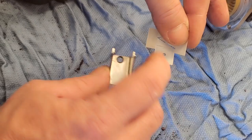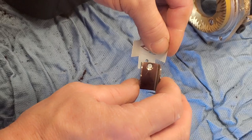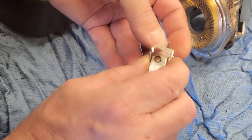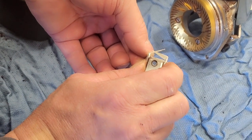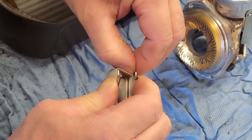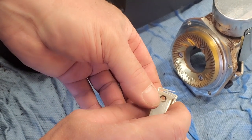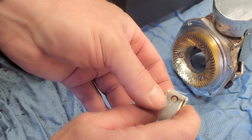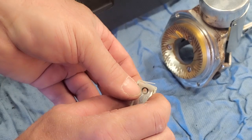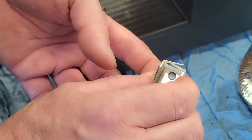This is the clump crusher — there's a screw hole there — and here's the slide with the screw hole. We want to line those up and fold everything over to approximately where it needs to be going in the machine. Then we want to break in our teeth just like that; you just fold them over once and that will be enough to line things up. Once you put it into the machine, everything will go much more smoothly. We're going to put our clump crusher and slide assembly back in the machine.